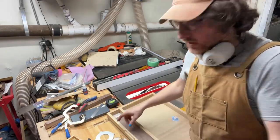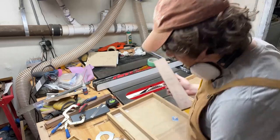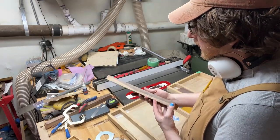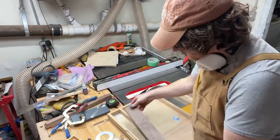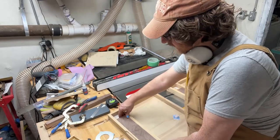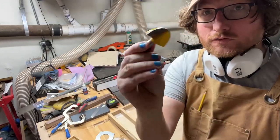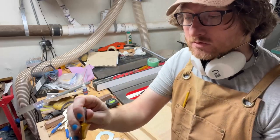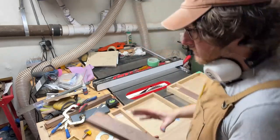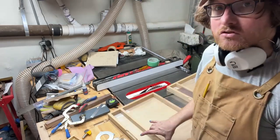Start work on these checker trays now. So I did decide I was going to do the side trays in walnut, just to go with the splines and make sense of the fact that there's two different woods in this. I've just ripped down a couple of pieces of walnut to fit exactly inside the side bar. Now I'm going to use this massive cove bit, which is the same diameter as the checkers, to run a groove all the way down the middle. Then I'll be able to cut this into 6-inch pieces, and each 6-inch piece will hold 15 checkers. So there'll be two 6-inch pieces.